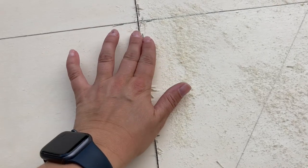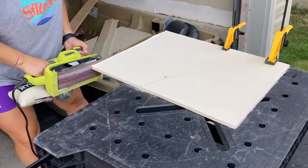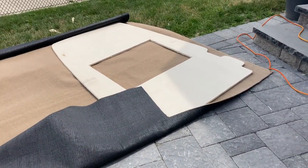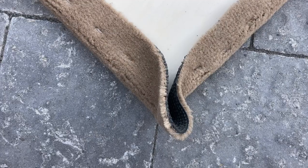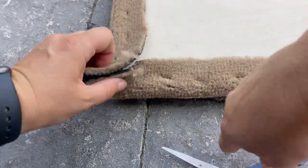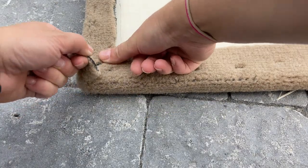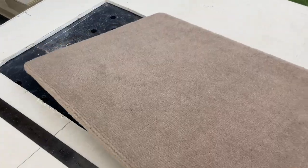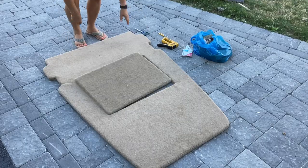I need a little bit of a gap so that when the carpets are together they're nice and snug but not too snug. I'll sand it down nice and straight and cover it with carpet. I want the vertical lines to be the same for the hatch as for the main boat piece, so I'm measuring to make sure the direction matches. I cut off some of the excess and pull the leftover. If anybody knows how to properly upholster carpet around edges, let me know. Because of the carpet overlay, the door didn't fit, so I had to extend the door by about a quarter inch and adjust it a few times to get it right.